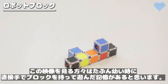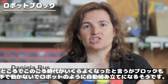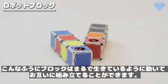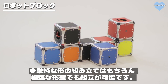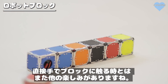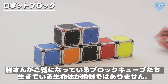Our objective is to design self-assembling and self-reconfiguring robot systems. These are modular robots with the ability of changing their geometry. If we do not know ahead of time what the robot will have to do and when it will have to do it, it is better to consider making modular robots. The approach that we chose is to use angular momentum — essentially there's a spinning mass that spins inside of the robot. The robot doesn't have to be in a certain position in order for the force to be active upon it.